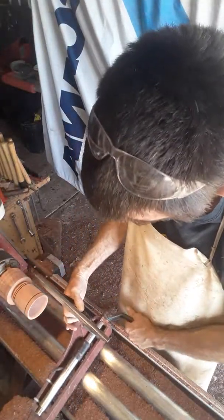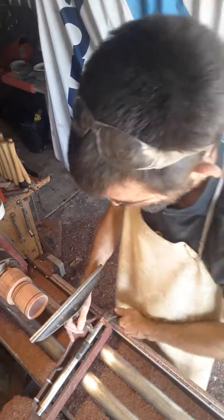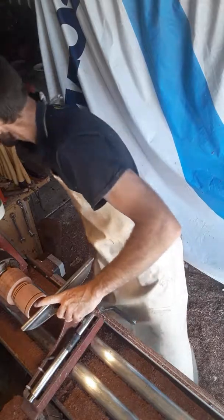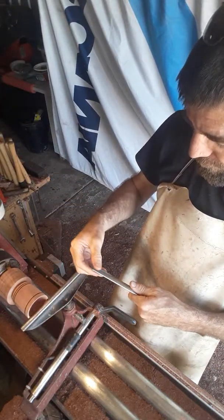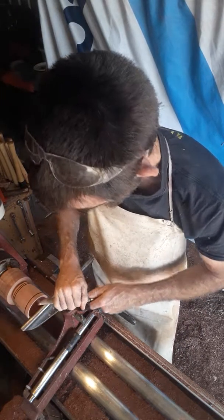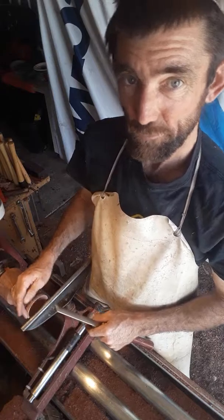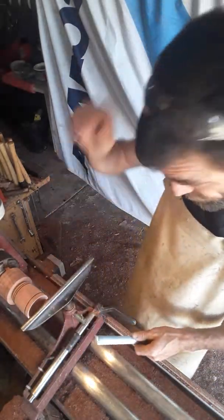So what I'm going to do — I'll bring this around. I do it with a skew; I did start with a different chisel but I like the skew now. Basically just come in from an angle like that and make it a nice curvature so you get that nice little spill out. You don't want it too sharp — we've made a couple with a sharp edge and it doesn't feel too nice, so you want to get rid of that sharp edge and just make it a nice little roll.